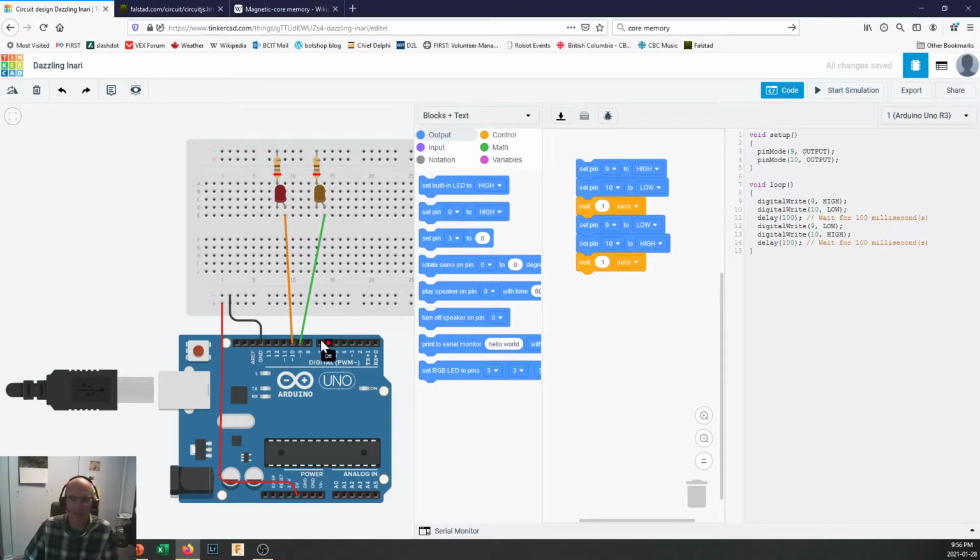And we set pin 10 to low, putting a transistor on that connects it to your ground side, which also comes from your computer. So that's all that those two commands do. We wait for 0.1 of a second. Now, I think we might have said 1 second last time, but we sped it up a little bit, and I'll talk about that when we take a look at the code over here. And then we come along and we flip it and we set pin 9 low, pin 10 high, so that we change their states, and we wait, and then this code keeps on looping forever.